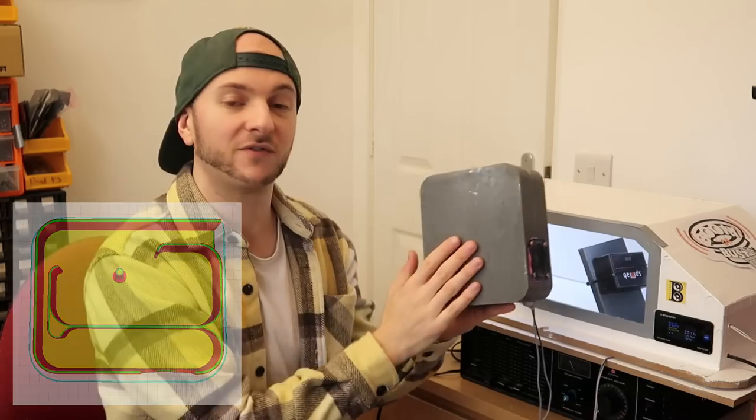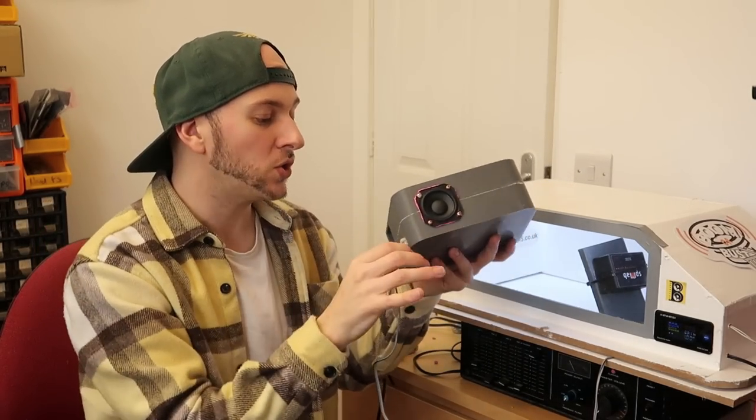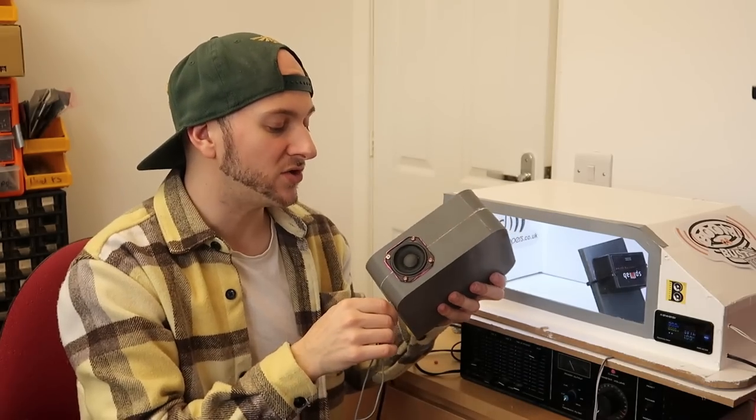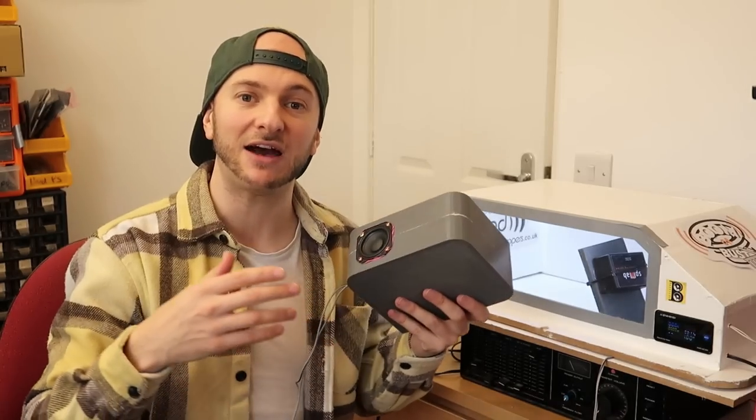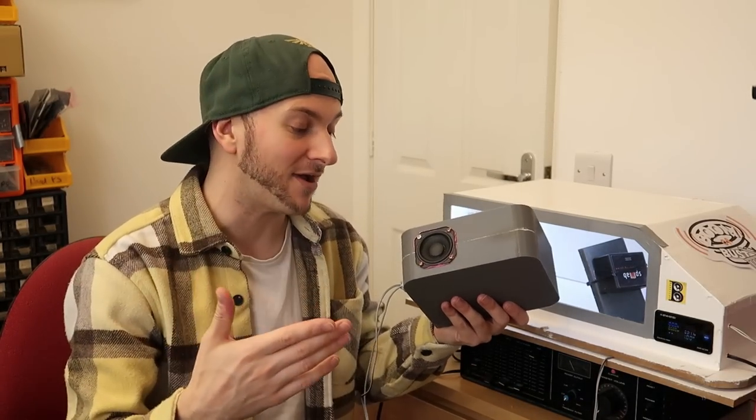So we've got higher frequencies generated by this port and low frequencies generated by this port with the full volume being used. Obviously the idea of this is that we get two frequencies that are Helmholtz loaded, therefore two frequencies that are boosted and are nice and efficient. These boxes are supposed to have a pretty loud output across a wide range at the expense of some delay, but we'll see how that goes.